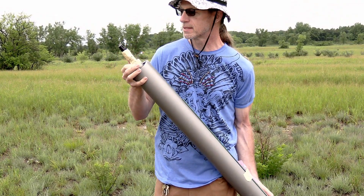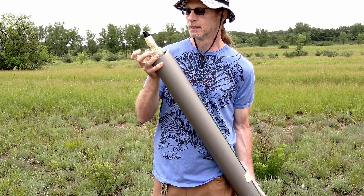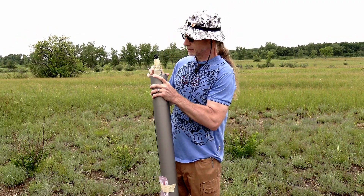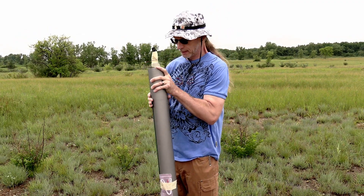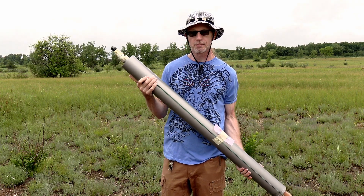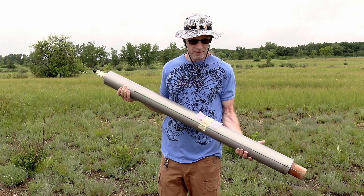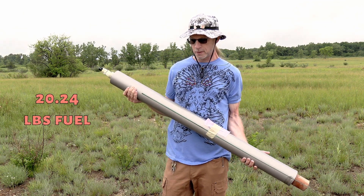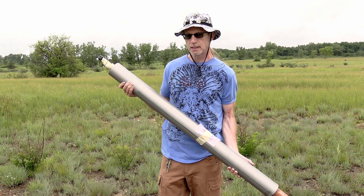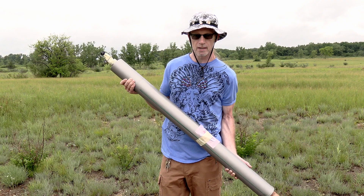I'm really excited to use this. It has a 1600 PSI pressure transducer up in the top and a little tiny 1S LiPo battery taped to the back. That hooks up to your computer — it has a simple CSV spreadsheet output and is very easy to use. The motor itself has 9,182 grams of propellant, so we should get about 19,810 newton-seconds out of this motor.